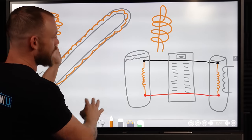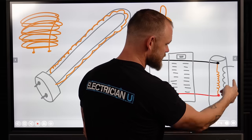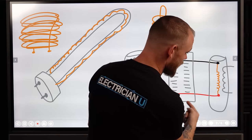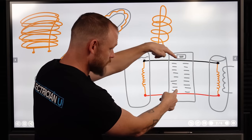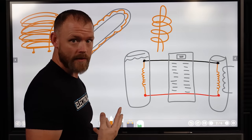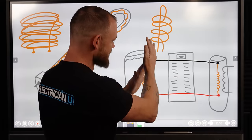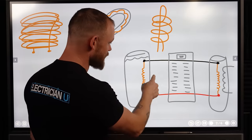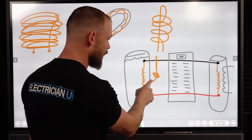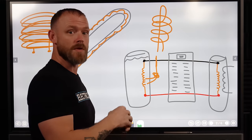So essentially what we have in a water heater is we've got the utility pole out here. This is your primary side that's not touching your secondary side. From your secondary side, you've got a coil wire. You've got a black and red that goes through a panel, through breakers, and goes to a water heater. And it's just another coil of wire, an element. So you have a complete circuit in between, and that's how a water heater works. Now, for what decides when it's switching on and off, you're going to have a thermostat in there that's going to cut it out at a certain point because it's got low voltage wiring in here that's going to talk to it and communicate with it. It's going to cut power to the main circuit.